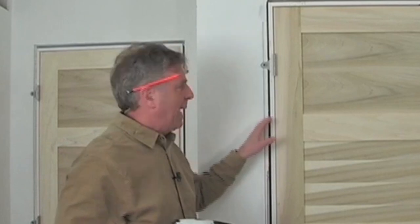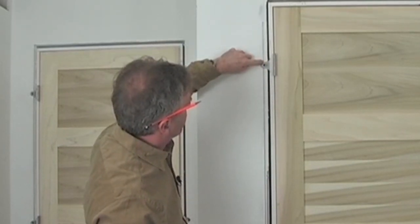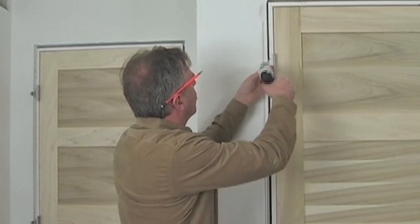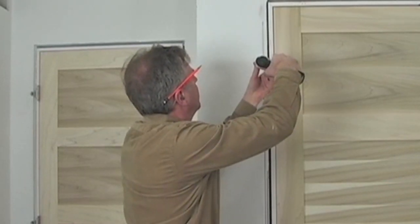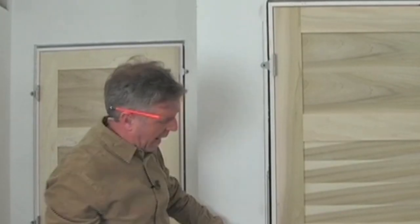Line up the first bracket on the level line side. Now, using one of the 3 notches of the bracket, screw in that bracket with one of the notches lined up with the level line. Use the same notch with the next 2 brackets on the level line side, and your door is perfectly level